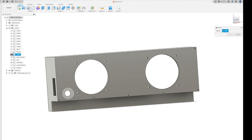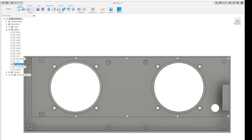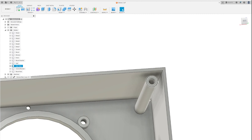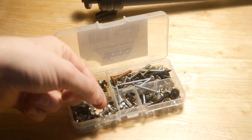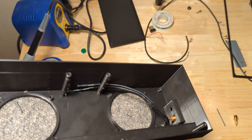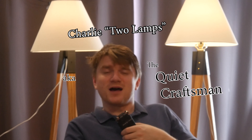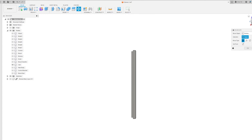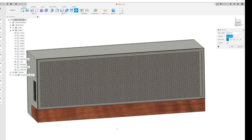The first thing I did was started to collect measurements. I knew I wanted it to fit under my computer monitor, actually to replace another set of speakers I found on the street. I also had to measure components like switches, and I used a set of very cheap calipers that have a dead battery and just sort of eyeballed half-millimeter measurements. Measurements in hand, I set off importing all of those numbers into Fusion 360, a program I kind of know how to use pretty inefficiently. The design is fairly simple — basically a box with cutouts for speaker drivers and holes for screws. I usually just design screw holes to be three millimeters in diameter and find random screws that fit from my little box of random screws, a move that may have come back to bite me later down the line.